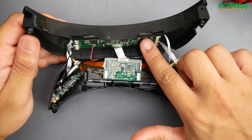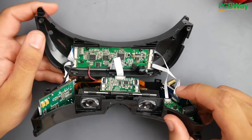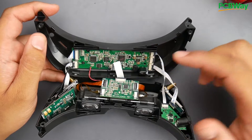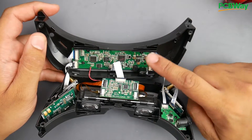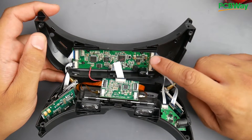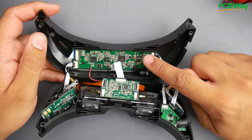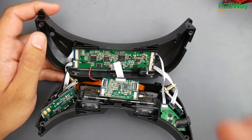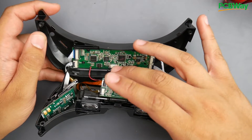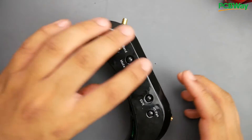They have the same capacitor and switching regulators. However, what they've done this time — I think they've gone a bit cheaper — because these were tantalum capacitors over here back then, and I remember that pretty well because that's where I had to take power from. So some of the surface mount components have changed slightly. I know for sure there were tantalum capacitors here before. I think one of the biggest issues that can happen with this is this ribbon cable, and they haven't done anything to address it.